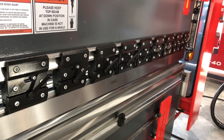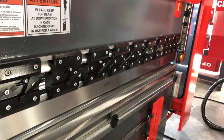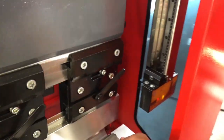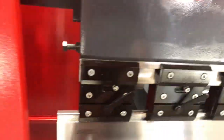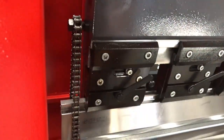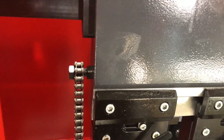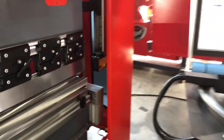As it starts to come up, I'm going to pause — I can pause at any point really. So we're going to pause right there and go ahead and attach these chains on the side so that I can lift this bottom V-die. We're just going to go ahead and take these chains and put them on our chain lift points. You've got a lift point here on your upper ram and then you have a lift point here on your bottom V-die. Same thing on this side.